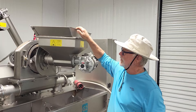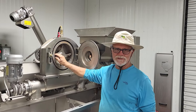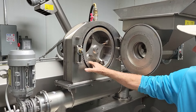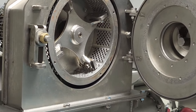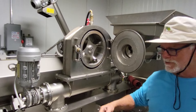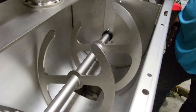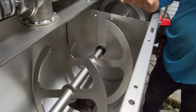The olives go through here, then they go through this series of knives that cut the olives and cut the pits as well. It chops it, pushes it through this grid, and then it falls down into what looks like an ice cream churn. It kind of works like an ice cream churn, and just slowly, for about 45 minutes, this apparatus turns and starts the separation of the oil from the paste.